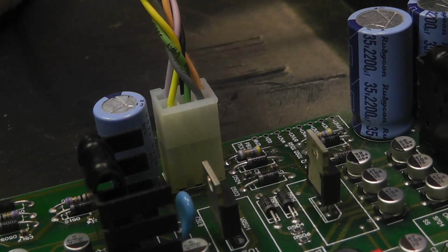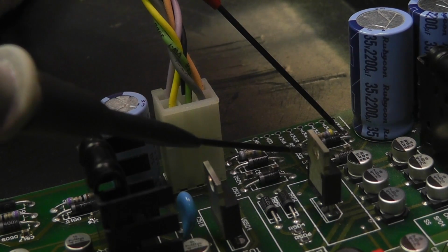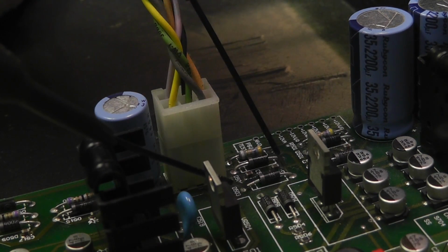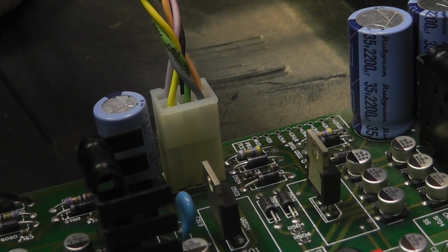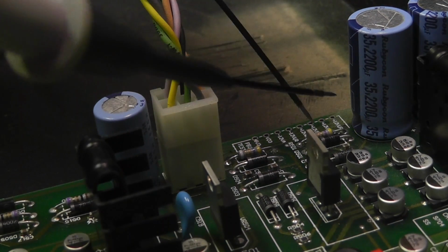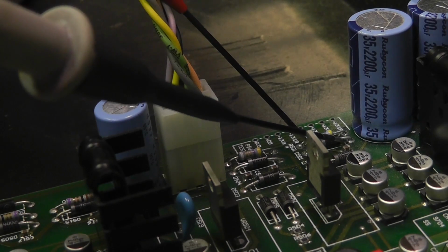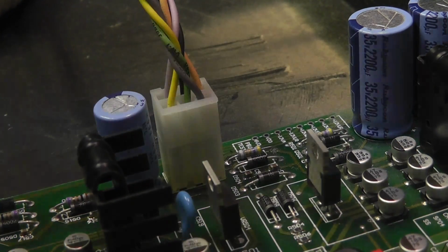Right, let's do a quick check on the diodes, make sure we haven't got any open or shorted diodes. So we're expecting a beep from the meter in this direction. One beep. Okay, another beep. This one. And this one. Okay, it takes a bit longer if the cap's charging up. I've got 3 more diodes here, checking these ones. Yep. Yep. Okay, and they're reversing. Nothing, correct. Nothing. Nothing. That's a bit leaky there, but it's charging the capacitor up. You can't see the meter, unfortunately, but it's charging probably this electrolytic up at the back here. So that looks okay.